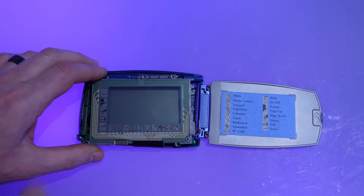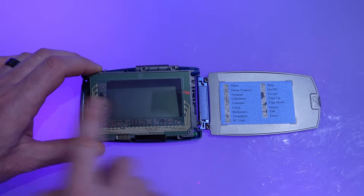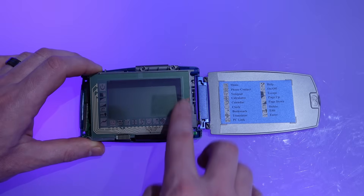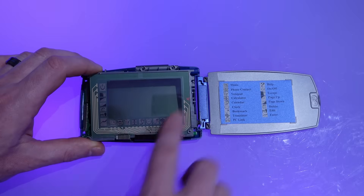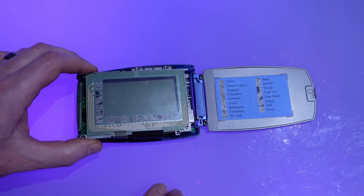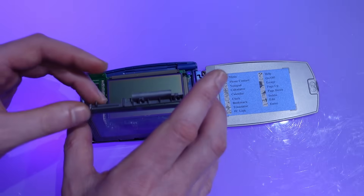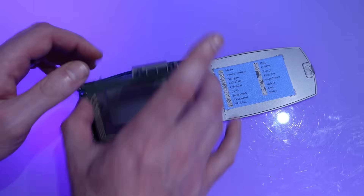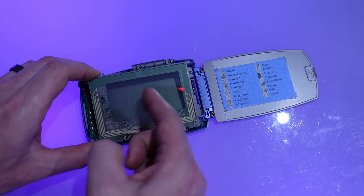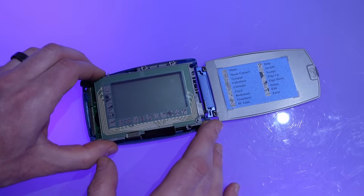This screen is quite unusual for two reasons. First, it doesn't use four wires — instead there are four wires on this side and four on this side to give the array, all meeting along the bottom. The other unusual thing is this grey plastic spacer actually creates an air gap between the LCD and the touch-sensitive panel. That means it isn't resting on anything when you press it, whereas normally it would sit against the glass to give some resistance when you put your pen down.